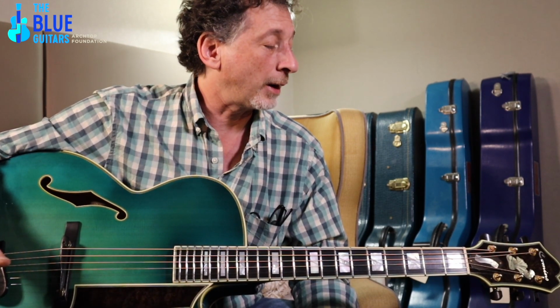There were touch-up issues in the color that I had to address when I was repairing the binding and lacquer. And the only difficulty there was, it was a very specific color Scott asked us to use for these guitars. It was a Mohawk product. They still make that product with the same number, but they changed the formula, I think, right after they made this collection. As it turned out, I saved some original lacquer that I sprayed on this guitar. And it was just in a jar for 30 years or whatever it's been in my shop. And I still had it.